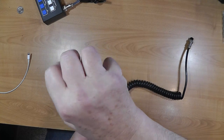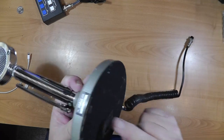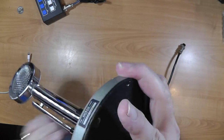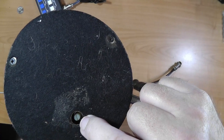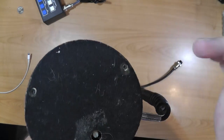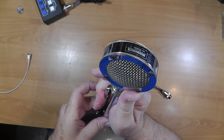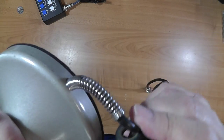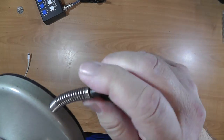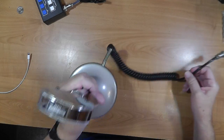This mic is a high-impedance crystal mic, and everything today is low impedance. So this has in the base a little amplifier, and there is a volume control right there for it. There's a nine-volt battery in here, and that is only turned on when you press push-to-talk, so it's off all the rest of the time so that the battery lasts a long time. And you'll note the spring around here to keep from breaking that cord — that was back when they really made things sturdy.